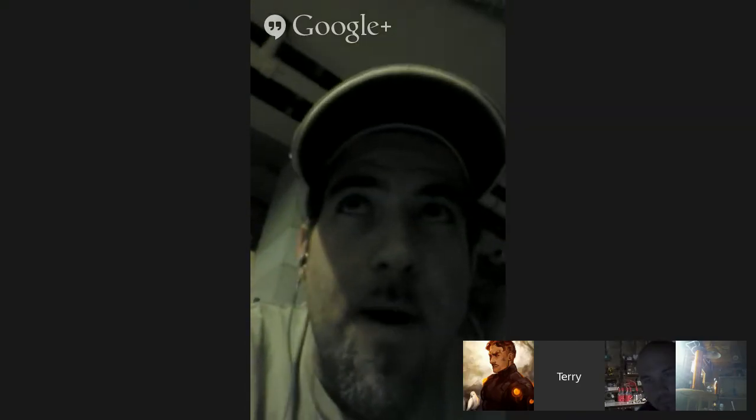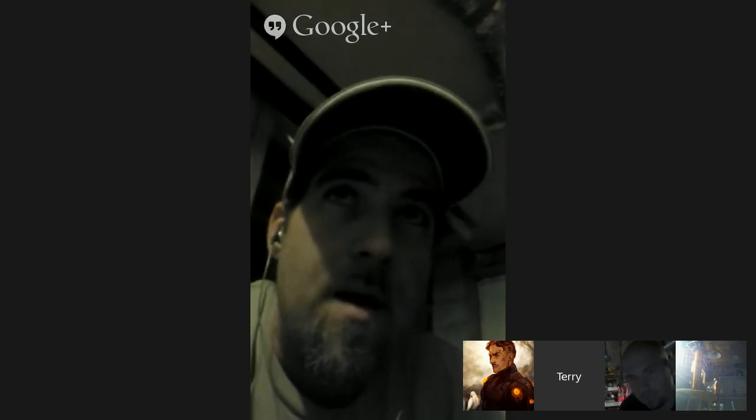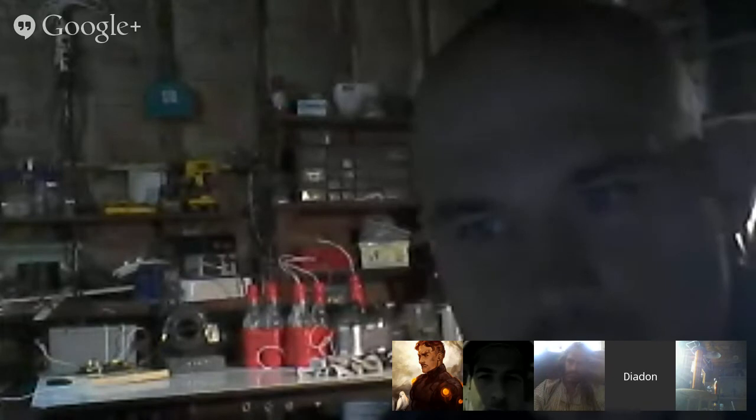The L1 is being used as a step down, and then he's using that as the voltage to run the L3. What are you stepping L1 down from? What's your supply in? What are you driving with? The Slayer? The one I've got set up will run from 9 to 36 volts. I haven't pushed it beyond 36, and I'm using a 2N3055 from Radio Shack, the one in the can. Yeah, NPN, just the general purpose one, right? Yeah, it's good for 15 amps.